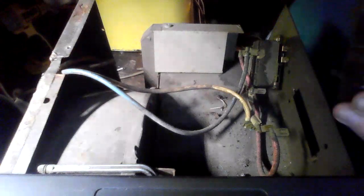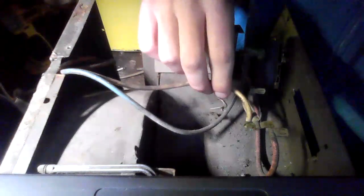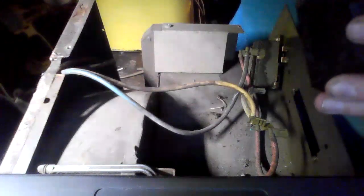I hope you guys found that helpful. In this case, you know, the air conditioner — you just have to clean the switch out real good and clean the terminals and the wire leads. Now, guys, what we're going to do is have a part two of this video where we're going to show you how to rewire it. Power is turned off, the unit is unplugged, and I also shut off power to the circuit at the service panel.